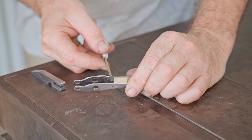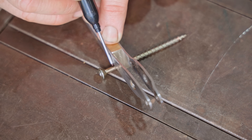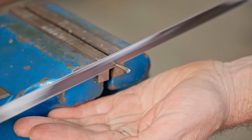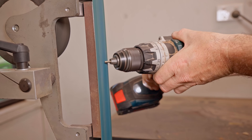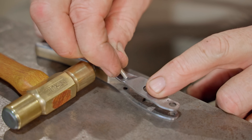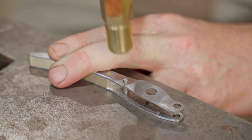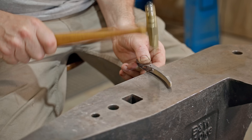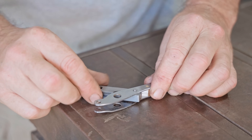The handles are just about done — I just need to fix in pins to ride in the slots on the jaws, and for that I'll use these wood screws which have the perfect size shank. I'll be peening the ends to keep them in place, so the pins need to be slightly longer than the width of the handle. To peen the ends I get to use my Christmas present from my wife Kath — it's this awesome carbide hammer made by my mate Corin. He's made and sold a few hundred of these and I know he has another batch on the go. If you're interested in getting one yourself I'll put a link in the description. The screw was quite hard but the carbide inserts on the hammer peened it over with no trouble at all.